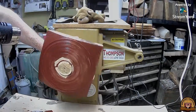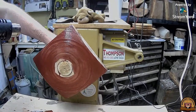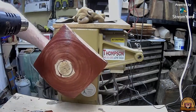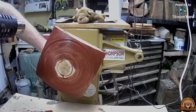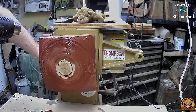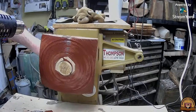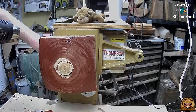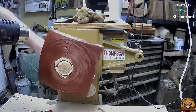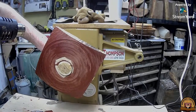So you dry each layer as you go through it rather than letting them wet and mix a little bit? Do you find that to work better or just trying different things? I've never tried doing two colors while they're wet. This way I know you can kind of get that sanded-through worn look like farmhouse furniture has sometimes with the milk paint. Gotcha. And you can see when it dries it's kind of a different color. But it basically looks the same color as it did in the powder form.